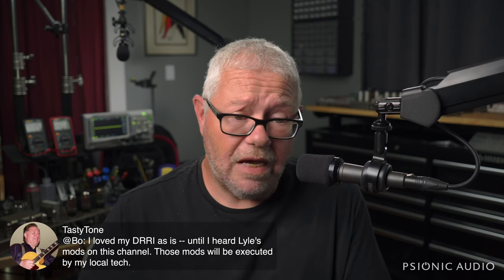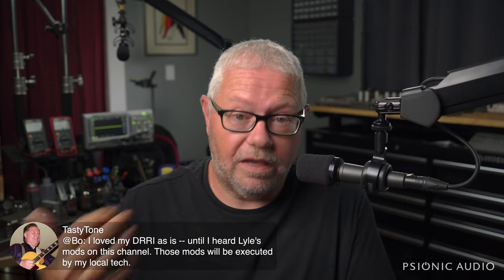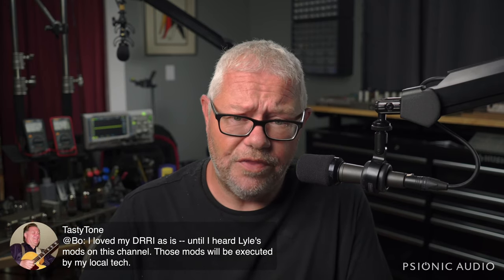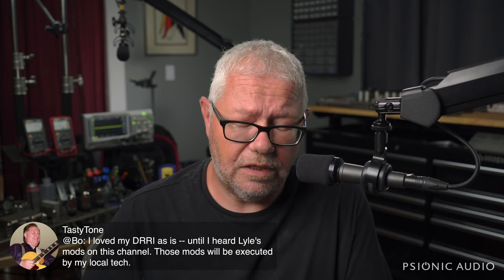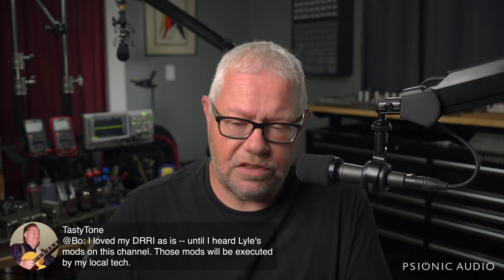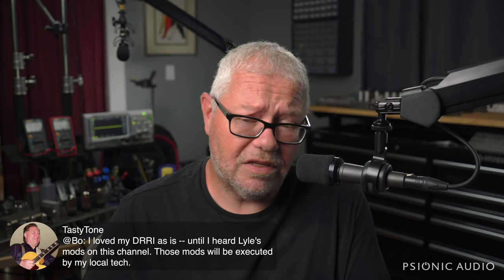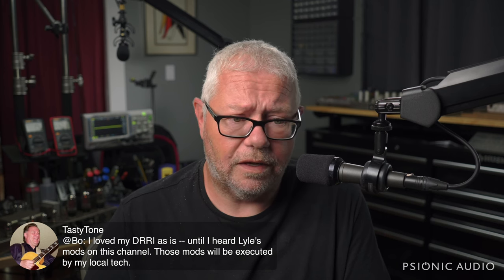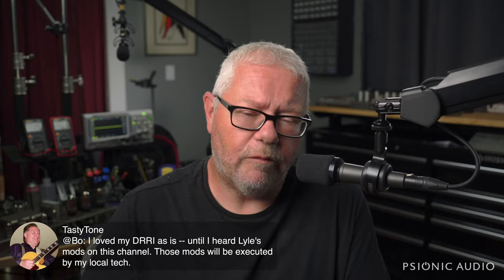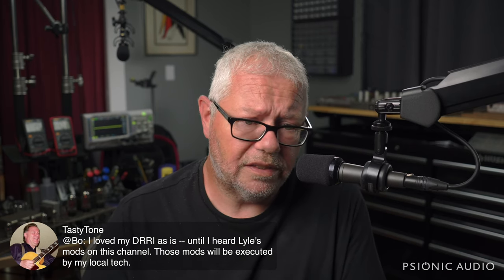Tasty Tone, thank you. I'm not making radical changes to the 65 Deluxe Reverb reissue. I'm making it sound better, but they're mostly fairly incremental changes that add up. The biggest contributor is going to be just getting the hiss out of the vibrato channel by running a shielded wire where they have the trace, and then the additional mids pot, if you do that, really adds a lot of flexibility. But just having it so the board's not going to catch on fire, and those crappy caps aren't going to, long before they leak or hum, be preventing the amp from sounding as good as it could, because those icy brown caps are bad. And like I said, that speaker has got to be changed out.